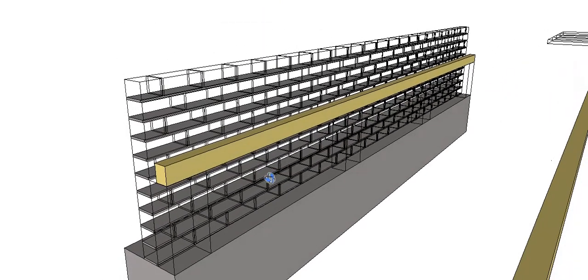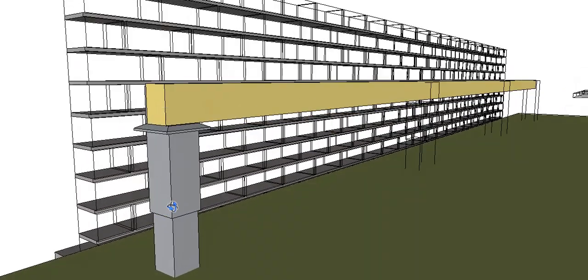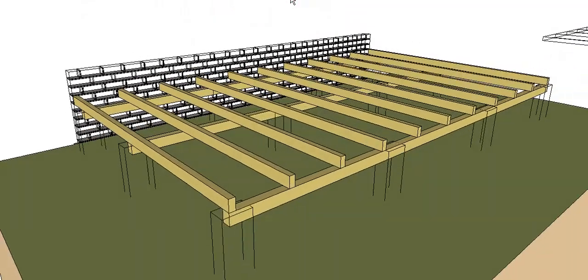The other problem with doing engaged piers is you have to dig down to your original footing. Hopefully there's enough footing left to put the pier on — otherwise you'd have to be bulking up the footing as well. So it's not a very common method. It's more common to just build the piers off the wall and put them on their own footing. That way your bearer is going to be a long way off the wall when we put our joists in.